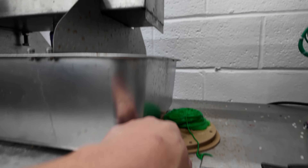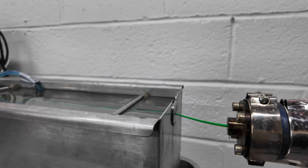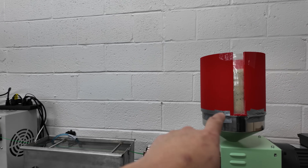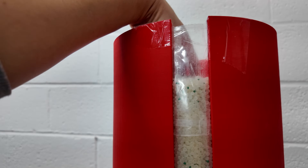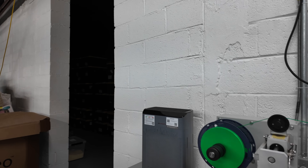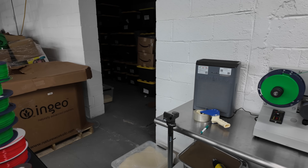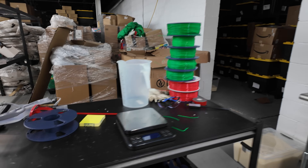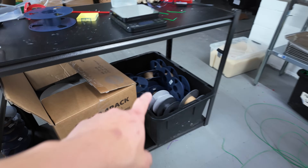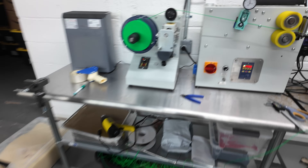I probably have to take off these cardboard spools here just so that this thing is a little more level as it comes out of the nozzle. But essentially, once this thing is up and running for the day, all we have to do is refill the hopper with more colorant and more resin as it gets low, and then every 30 minutes or so come here and change out the spool. We've been using all of our Sunlu spools — they're exact replicas of the Bambu Lab master spools. We have a whole box full, more spools there, so we have plenty of spools for winding this filament.